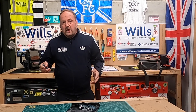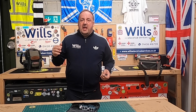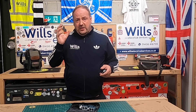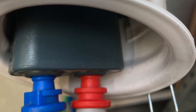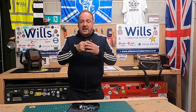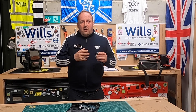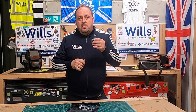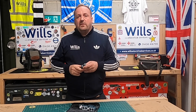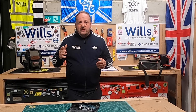If you're using the two-plate wiring system — two plates feeding the switches in each room — what I'll do is when we're second-fixing the downlights, the end-of-line one in each room I'll leave hanging out so I know I've got to go there and test it. I'll plug these in — they've got two ports on them, line and neutral — and literally just plug them in and put the earth on the housing.